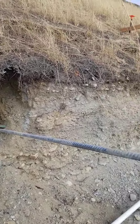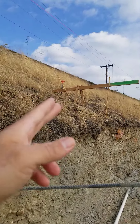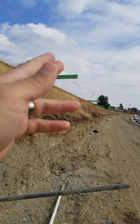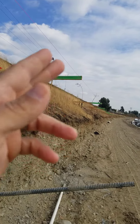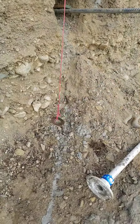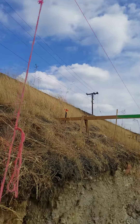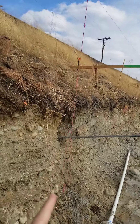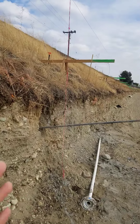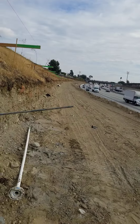The way to cut it is we have the survey, so we perform our takeoff and set up our line. This is an old trick that we use — we have this little piece over here that we can drag with as we go, and we use it to pull the tape to perform our final check for the grade so we don't over-cut the wall.